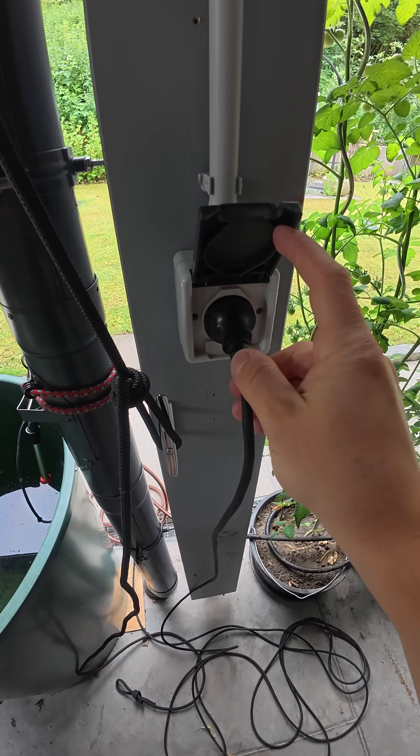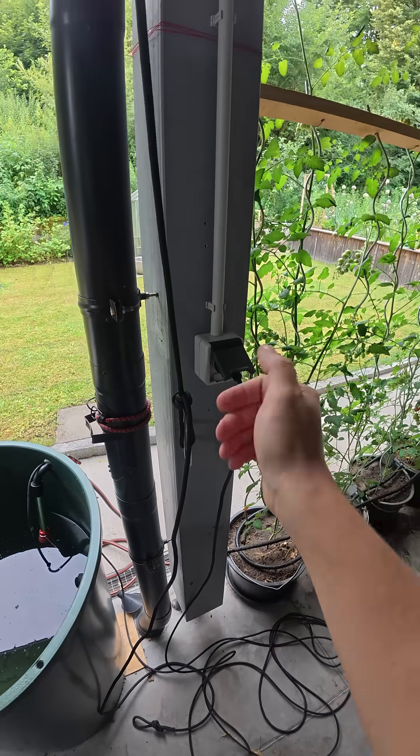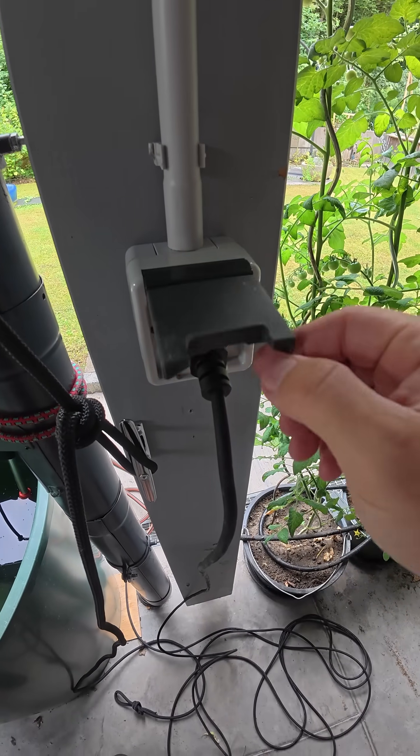And that's what I meant — if you put a super high load on the socket, which for now is unusual, but maybe in a few years you just put permanent power on it, and then the mini server's relay could burn.